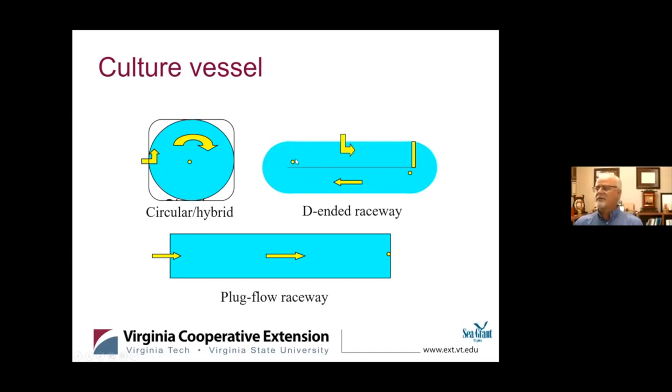And on these, the places to pull the solids for self-cleaning are on the downstream side of the wall where there's an eddy. So the solids will collect here, or you can put a screen on the bottom and have a discharge on the bottom of the tank so that the solids fall to the bottom as they come down, and then they get pulled out here. So you have three points where you can pull solids out, again, to be self-cleaning. And so probably whatever you come up with will be some combination of these shapes. But most importantly, keep in mind self-cleaning, and that the fish need to be able to swim without corners.